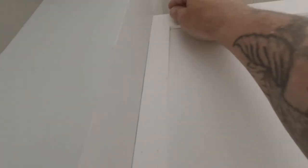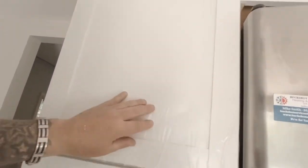Yeah, press it right in there. I can even put a little clamp on there, put a little pressure on it. We're not gonna nail it. We're just gonna bring it right down, nice and even. So now we have the look of the, what do they call these? Leave a comment if you know. Shaker style, but we have basically the same picture frame going on. There it is, the kick plate that's gonna wrap around.